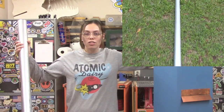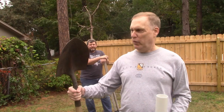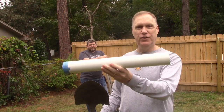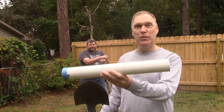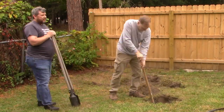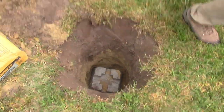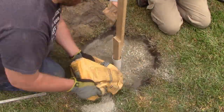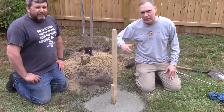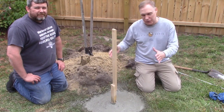Now all that's left is to pour the concrete. We're going to dig a hole with our shovels and put in this tube that the pole will slot into, so it will be removable should we ever have to take the bat house down. The hole is three feet deep with a footer in the bottom and two feet wide at the top. When we started filling it with concrete, we discovered to our horror that it holds 400 pounds of concrete. This bat house isn't going anywhere. Thanks to Kevin, it's all poured and ready — just needs to cure.